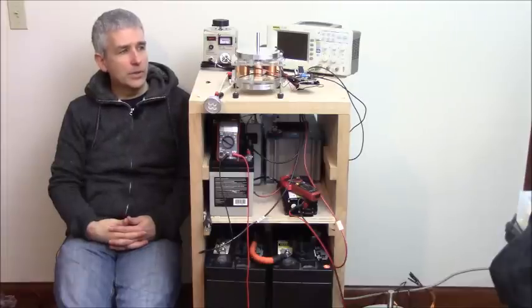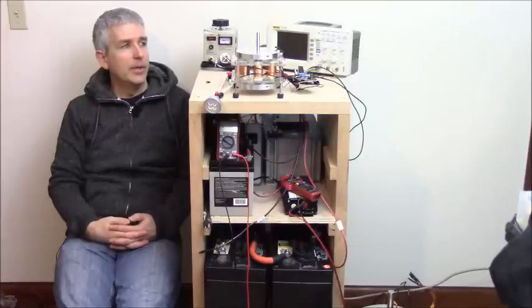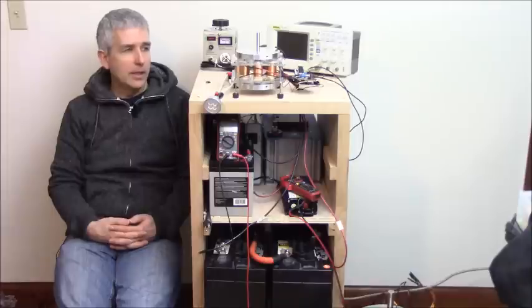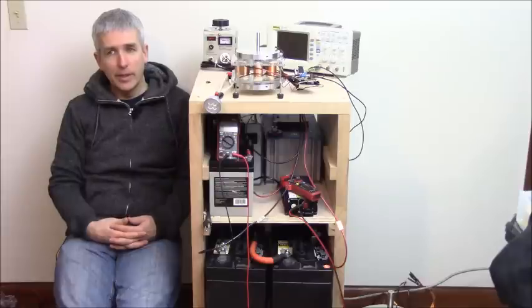Probably between those 2 spacers would be a more optimum range for the best of both worlds, you know, to produce torque and then also to create some real speed. Ideally, my rotors would be wider, as I said, but then it's not really going to be a mini kit anymore.